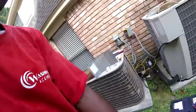But as far as the homeowner though, I won't be calling them talking about you need a flow switch or you need a crankcase heater or you need something to help your allergies out, adding all that. I don't do that. Right now anyway, I'm more of a service tech that likes to get your unit up and running correctly. I'm not going to try to sell anything extra that you don't need. I mean, if you need a contactor, even that contactor that was on there, it probably could have worked. This is it right here. But by the end of the day, if it'll be summertime, this thing can go out at any time. You see the condition of it. I checked the capacitor. The capacitor was within ratings. It's just rusty. It just looked old.